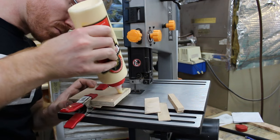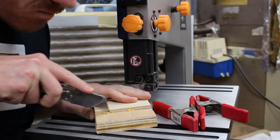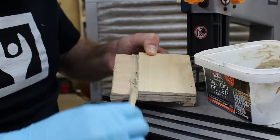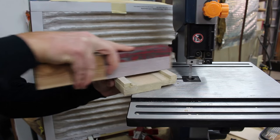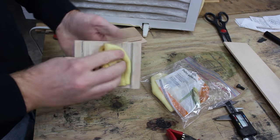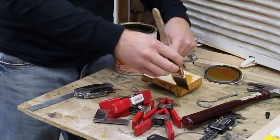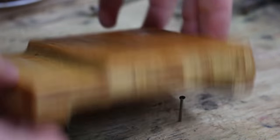One of the things I do is tilt the bed of the bandsaw about five degrees to give it draft on the side of the pattern, so you can extract it from the sand. I use wood filler to form fillets on the inside corners of the pattern — again, it helps with extraction. Then I sand that down, use a tack cloth to clean it up, and apply a little bit of shellac to help prevent moisture from the sand from being absorbed into the pattern.